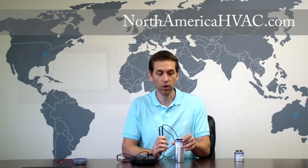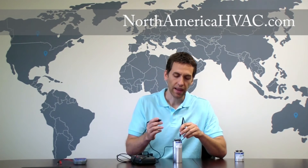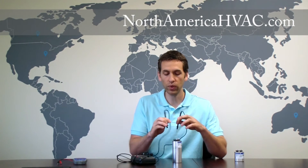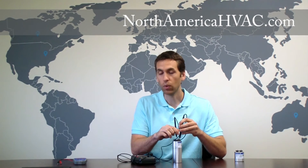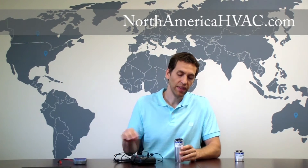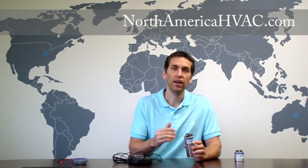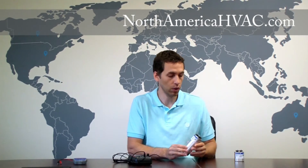You can do the same thing with a dual capacitor. Put it on the C terminal, and if we want to do the compressor, we would go to the Herm terminal — put one terminal on each side. The number slowly rises up. When you switch, you're going to start out with a negative number; that number will go back to zero and then rise up again exceeding your scale. When testing the compressor, the voltmeter is going to respond more slowly than when you test the fan side because there's more capacitance — a higher capacitor rating for the compressor that slows down the reading.